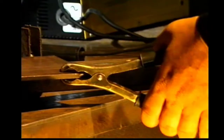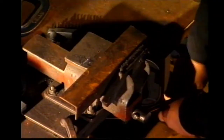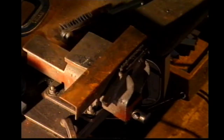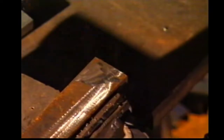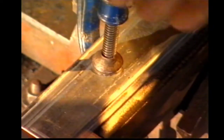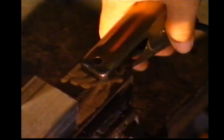After safety comes the start-up. With the job at hand, you must make sure the earthing clamp makes good contact. The workpiece should be clean, free from rust and paint. You can clean it with a wire brush supplied, or better still, use a grinder to give you a good surface for welding. The job should be secured with clamps or a vise where necessary to provide a stable base for welding. Attach the earthing clamp and you're ready.